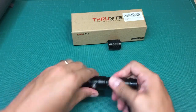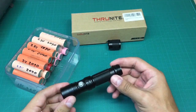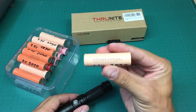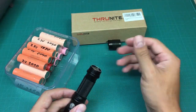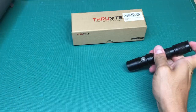This little flashlight is powered by one 18650 cell. It's recommended to use a protected one, but any other 18650 cell will work — for example, from old laptop batteries. At full power, this flashlight will draw about 3A of current, which is totally fine for almost any reclaimed 18650 cell from laptop batteries.